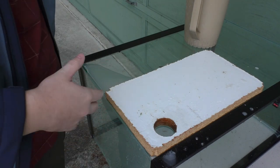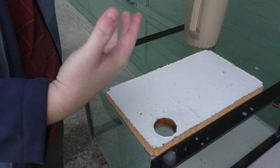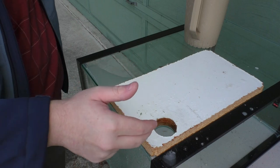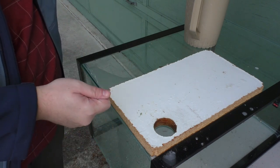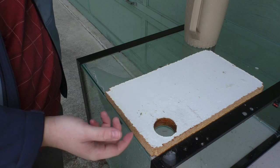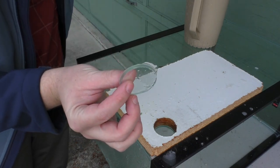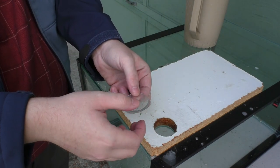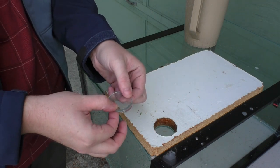And just like that, we've gone through. I've drilled easily over 100 holes and tried every combination — going slow, going fast, drilling from both sides — and no matter what I do, I can never get a perfectly clean hole. The thicker the glass, the easier it is; but on thinner glass like a 20 gallon, there's not a lot of room and you tend to get chip-out or clam shells. If you go too slow it can actually snap out a chunk, which is sometimes worse.